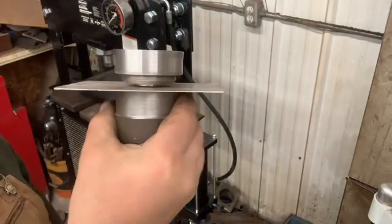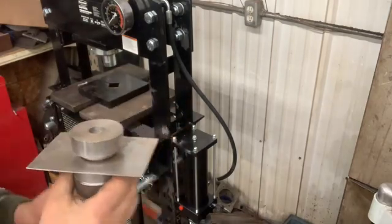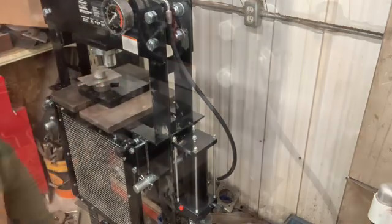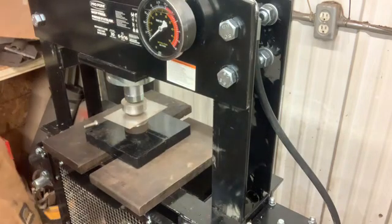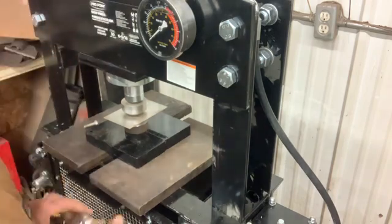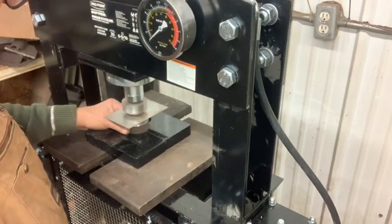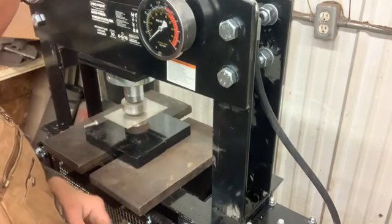We got her lined up like that. I'm gonna push down on it with my new press and see what the heck happens. Now, obviously, this isn't the only thing that press can be used for. There's a wide range of stuff you can use it for. You can push pins out, push bearings out. You can crush beer cans. It beats hammering the crap out of something to get it out, and you just destroy it. It's kind of a nice, clean, easy way. Good for ball joints.